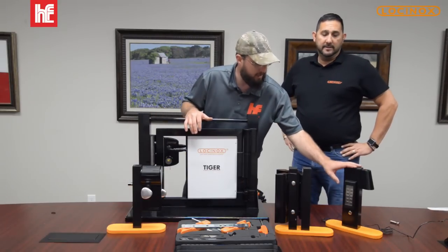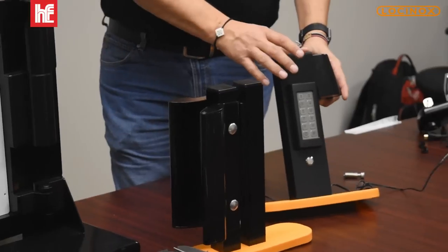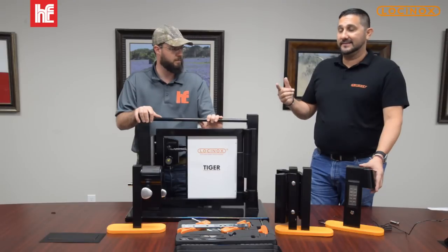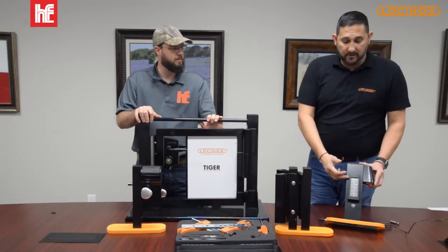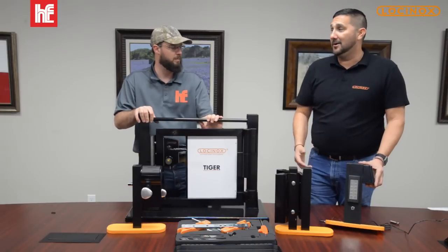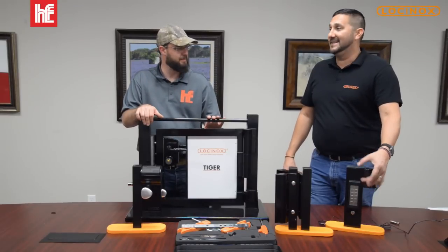And then can you tell me about the last product here? This is our Slim Stone keypad. It holds up to 100 codes. It's 100% outdoor rated. Everything we sell and install is outdoor rated. IP68 rated, weatherproof, tested 500,000 cycles before it's shipped out to you at our research and development site. The keypad will hold 100 codes, 12 or 24 volt DC, is 100% outdoor rated, is waterproof, and depending on where you are, you're working in Colorado, it'll go to minus 22 degrees. It's going to work in the cold weather because it has a small built-in heater.